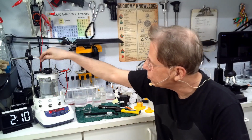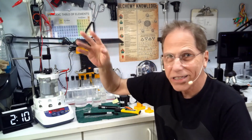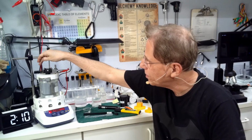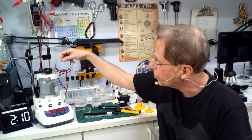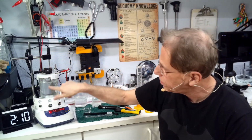But basically the high voltage AC is the same. I mean, you have to have two of the same material, anode and cathode, because it's AC, so you're going to be swapping the stuff off of each of the electrodes. So basically, I would have an anode and a cathode of the same thing, in this case silver, and then instead of having a low voltage power supply, I'll be hooking 10,000 volts up to it, within the liquid. It's pretty much similar to how we do a low voltage electrolysis, except we're using a 10,000 volt transformer.